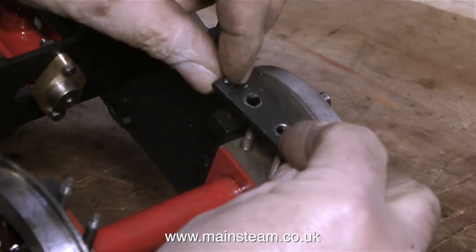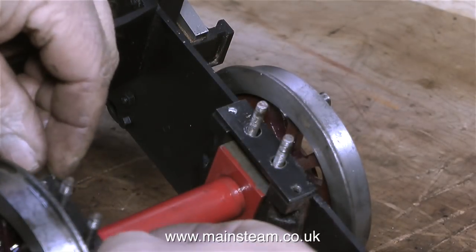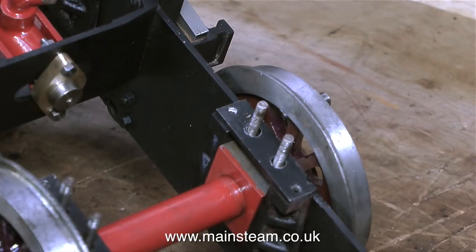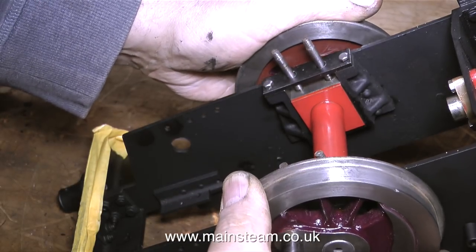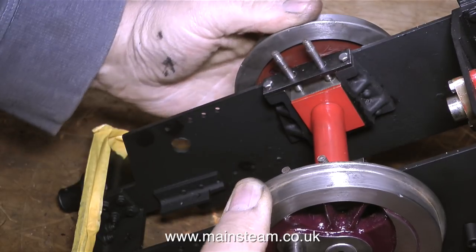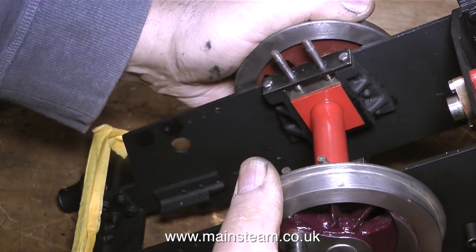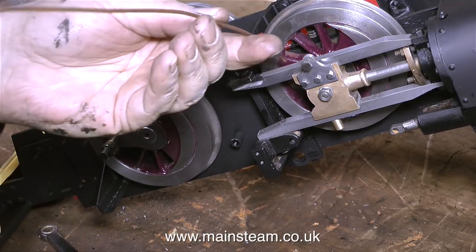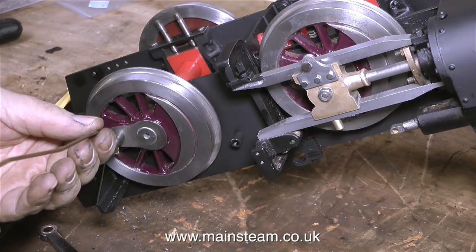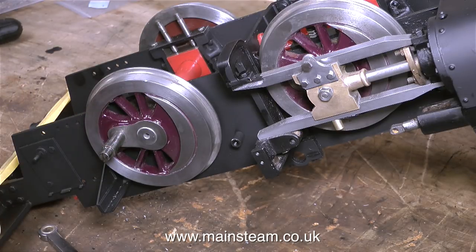Back to reality. I'm going to show something I didn't show when I put the front axle in place. The suspension on this engine was far too tight, so I drilled out every one of these hornstays so that the studs don't bind against the hole. The wheels have to be able to articulate — there has to be some side-to-side articulation in the way the axle boxes fit in the horn blocks. Miniature railway tracks are generally worse than full-size for being uneven, and the wheels need to be able to pop up and down. If the articulation is not present or the suspension is too stiff, the engine is going to come off the track.